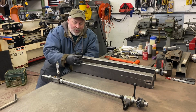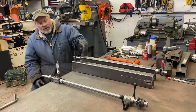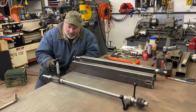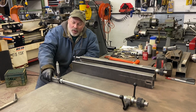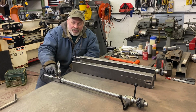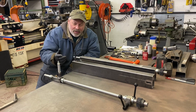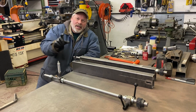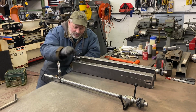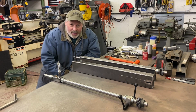But I'm hoping I'll be able to move the shaft just by this hand motion here. So, you know what I mean? Or I could just grab the dies, but I'd prefer to do it up here, I think. And at the last minute, next to my rosette weld, I drilled and tapped 1/8-inch pipe for an 1/8-inch pipe grease fitting, which I can access right down through this hole without disassembling using my needle. If you've ever seen a grease gun needle for getting hard to reach grease fittings and U-joints and stuff, right down through the hole, right into the grease zerk, and I can fill that up once a decade or once a century.